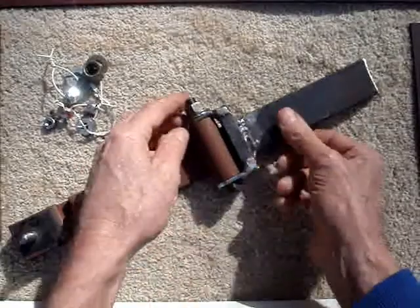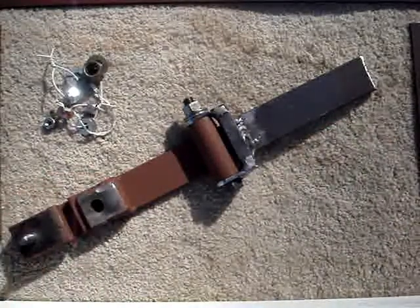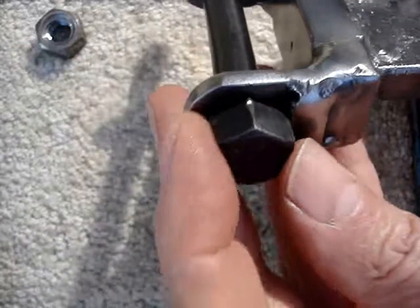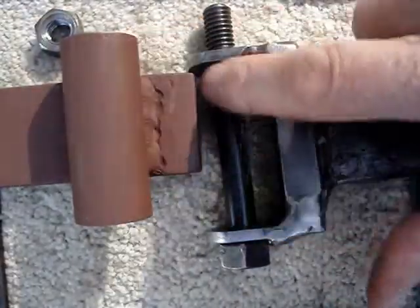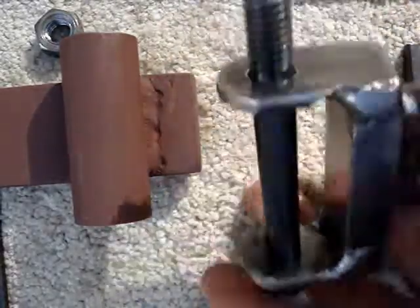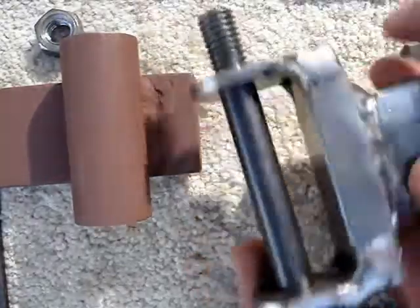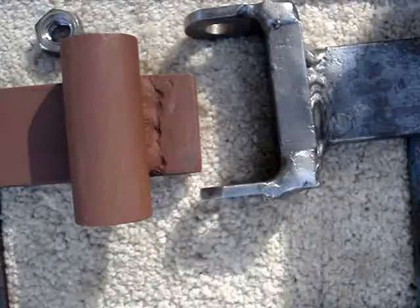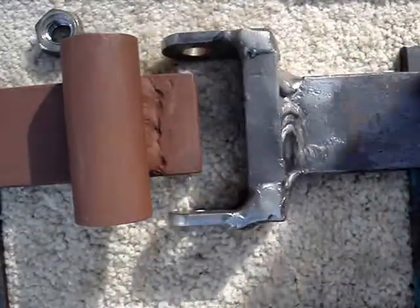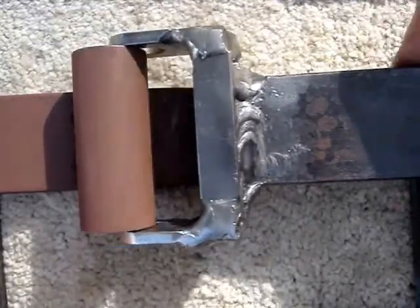The pivot is from here to there. I want the bolt to be stationary, and I want this part to move on the bolt. So this goes there, and then this lock nut goes on the other end — it's one of those old lock nuts with the brown insert. There's probably more of a weldment than I actually needed, and the materials I used were probably heavier than I needed, but they're what I had around.